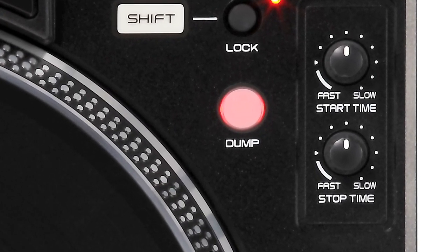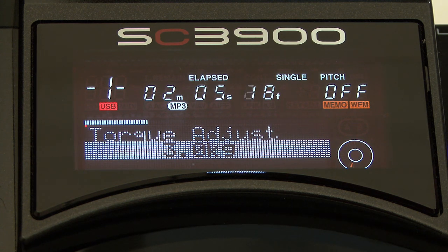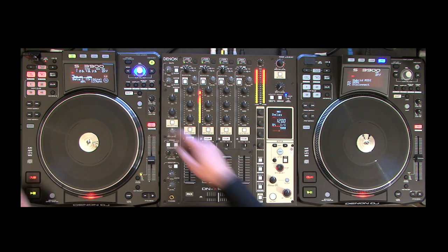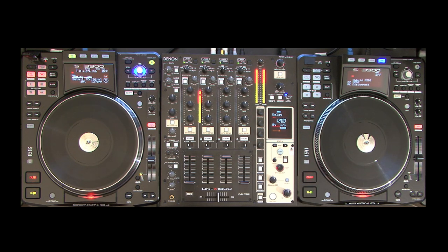It's a nine-inch platter with adjustable start/stop times and even a marker set to 0.3 seconds, which matches the start/stop times for the original Technics SL-1200 MK2. You can also use the utility menu to set the motor torque between one and three kilograms. There are two effects on the SC3900: reverse and dump. The other effects from earlier models have been removed — the reverse effect simply reverses the platter and audio, while dump reverses the audio while keeping the timecode moving forward so you can jump back in time after using it.